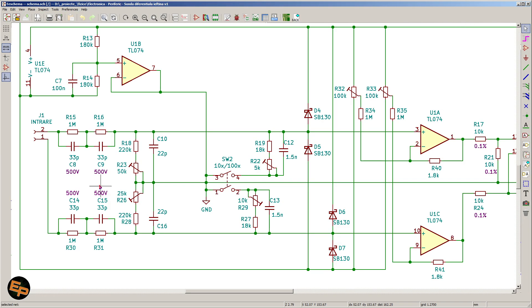This is why I have two 1 MΩ resistors for each branch, and I've placed a 33 pF capacitor in parallel with each of them. These capacitors need to be high-voltage ones, so I found cheap 33 pF capacitors that go up to 500 volts each — more than enough. If we put two 33 pF capacitors in series, we get an equivalent capacitance of 16.5 pF. This is why we have this capacitor here — it is the equivalent of those two 33 pF ones.